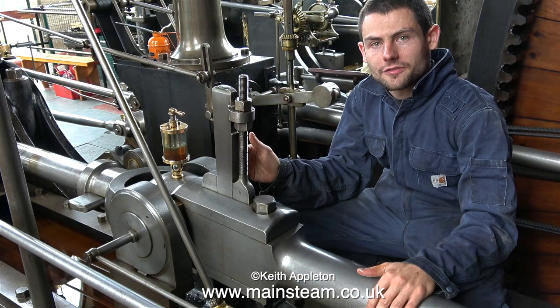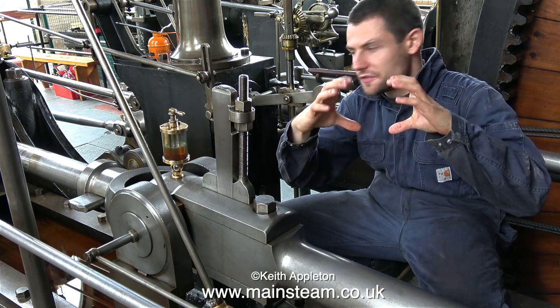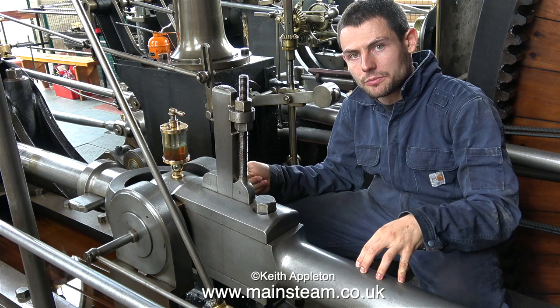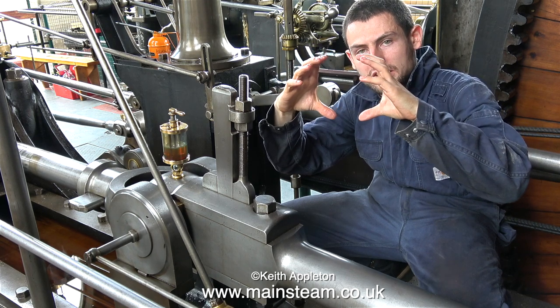The moving wedge is the first part of the principle. There are two halves inside the rod end, comprising the bearing. One is fixed, the other is movable. The wedge bears against a gib key, or sometimes against the back of the movable half. The further down you put the wedge, the further in it moves the movable half and then presses against it.